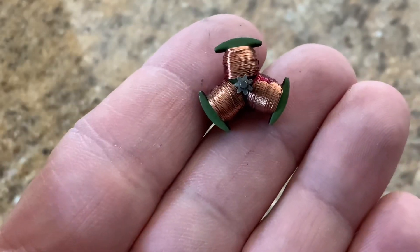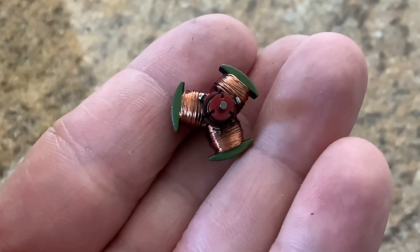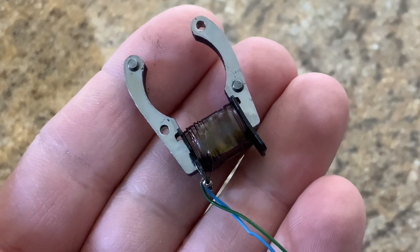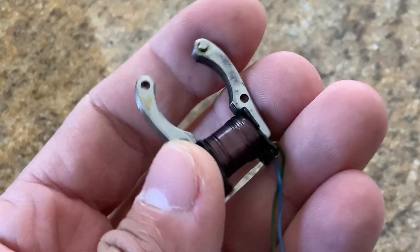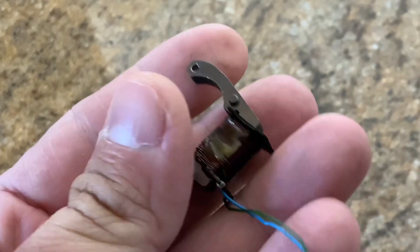The components you already have inside of your Hag or Marklin are actually already suited to converting to DCC, and you don't really have to do anything expensive or special. The magnet here is just fine, except it's not a permanent magnet like you need for a DC motor — it's an electromagnet. So all you need to do is run some current through it and it will actually turn into a magnet that you can use.